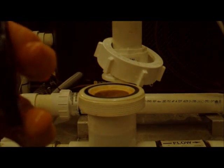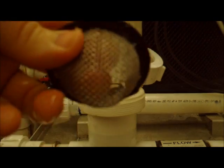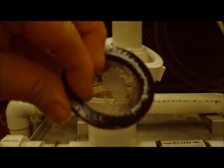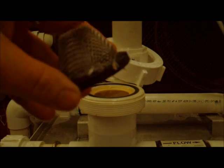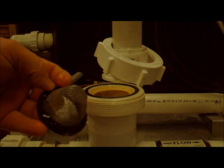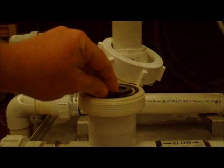As you can see sometimes you'll get little PVC shavings, a little bit of things that just catch up right on that union screen. You just want to make sure that that's cleared off and that it's good and clear. Make sure you've got no blockage or anything. You can tap it off, make sure it's good and clear, and just put it right back in the system.